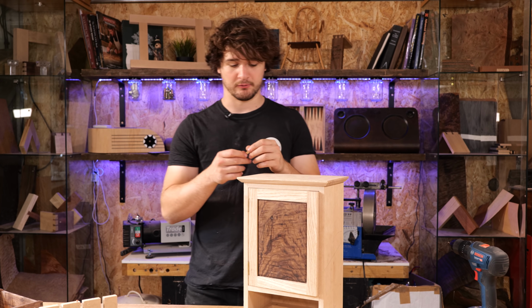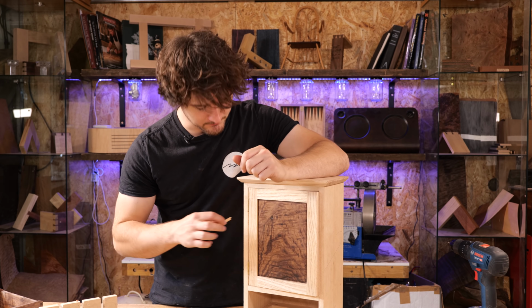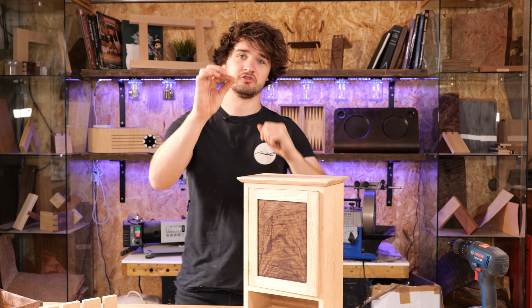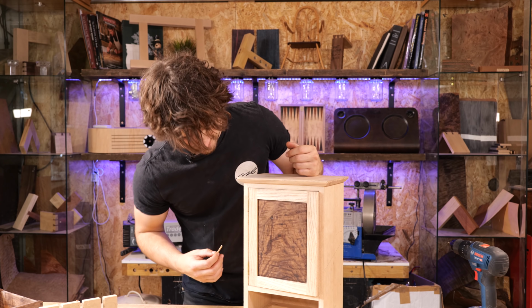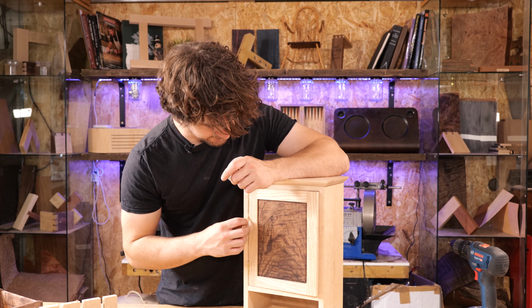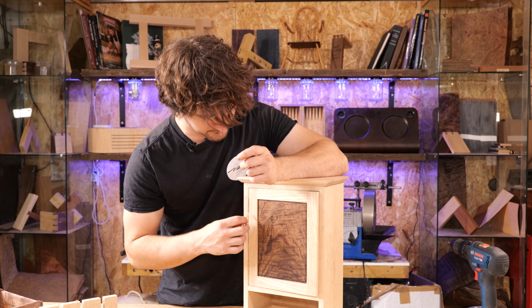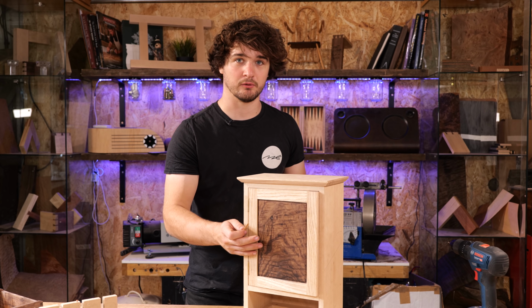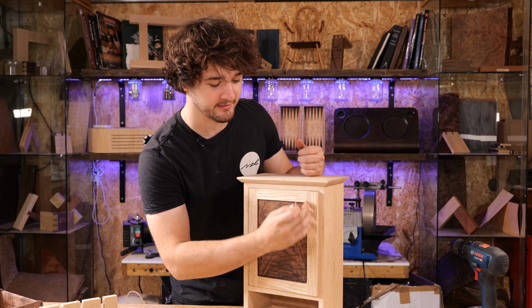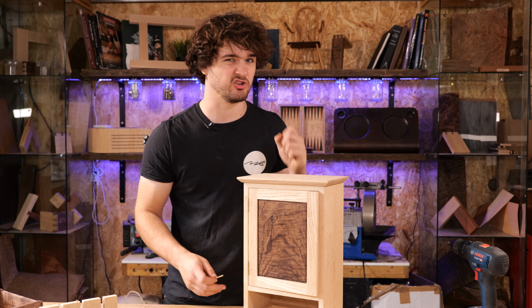And so the way I'm going to tackle this is find myself another shim that fits down the gap created by the hinges perfectly. In this case, it is 2 sheets of veneer, which indicates that this gap is actually about 1 millimeter wide, which is a little bit more than I anticipated, to be honest, but it's not a problem. It will look really nice when that's all even. And so now we're going to need to remove this door again and resize the door according to this new shim by taking material off these remaining 3 sides. Shouldn't need too much though.